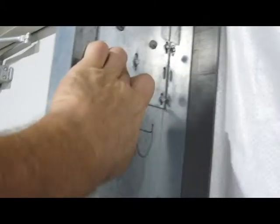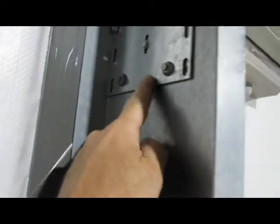The door works great — couldn't ask for anything else. What I ended up doing was cutting these brackets to fit in this gap because they went all the way across. One of the smaller screws broke off when I was trying to take it out, so I drilled and added four half-inch bolts to mount that plate. I had to take this plate off and flip it around so the tang went in instead of sticking out. I did the same thing on the other side — cut it down to fit, drilled and added two bolts, flipped it around, and added two big half-inch bolts. I put my header in and drilled and attached all the screws. Underneath those ribs I screwed through and put a three-eighths bolt in there.